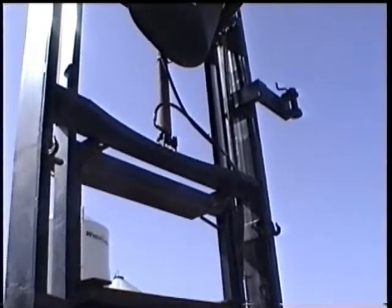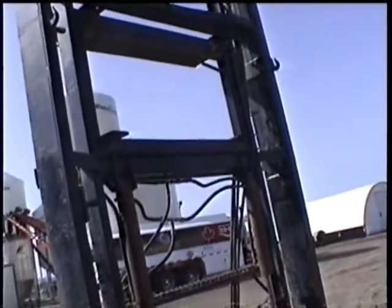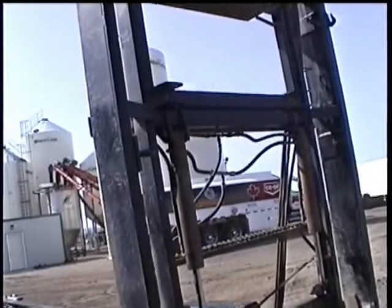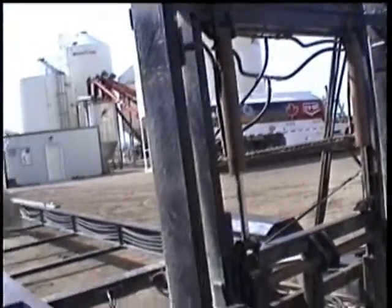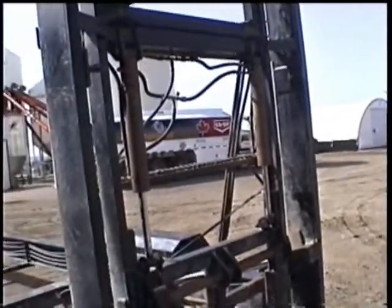It would be easier to keep everything as tight as possible with two guys, but sometimes you don't have that — it just takes longer. We are dealing with strapping at that point and the strap will flex a certain amount, so there will be a gap between your bin and the cradle. Once the bin is laid down in the trailer, you tighten that strapping up, get it positioned so it's all level, then tighten the strap properly. When you're ready to bring the bin back up, you leave the belt tight and leave everything as is. Set your bin up, take your ladder, climb up there, and back off your strap tightener.